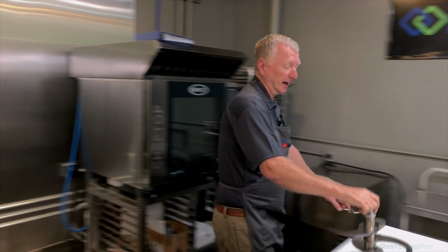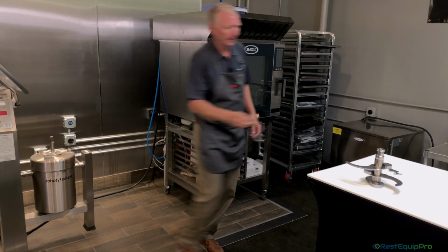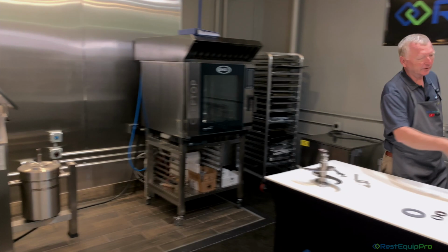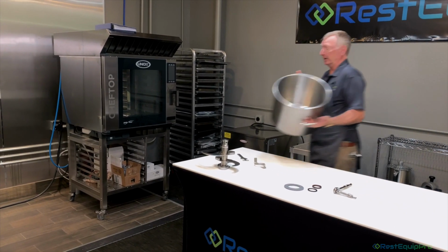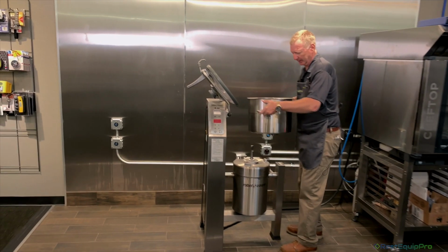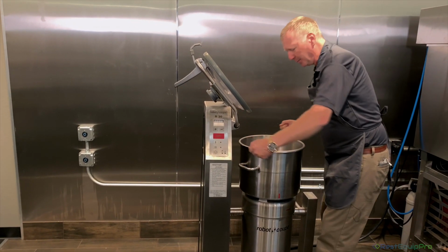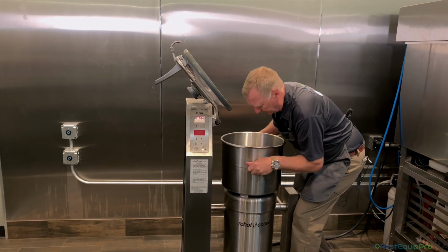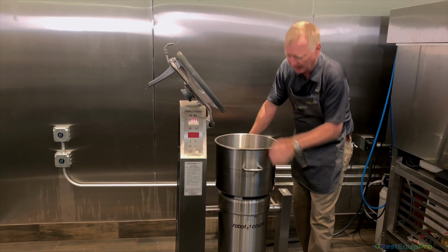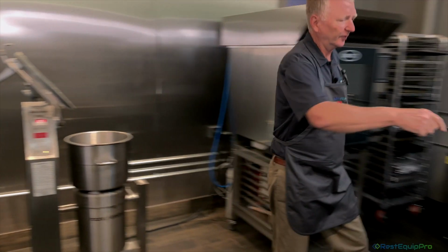Let's put the machine back together. Take the hub tool off. Let's grab our bowl. You've run that through the dish machine or over at the sink. Once again, pour lip to the left. We start farther around and come back in counterclockwise. Our 2 red arrows line up. Our pour lip is to the front, perpendicular. We're ready to put the blade set back in.